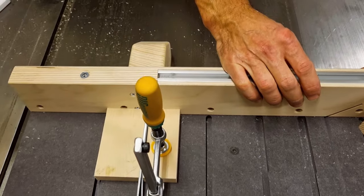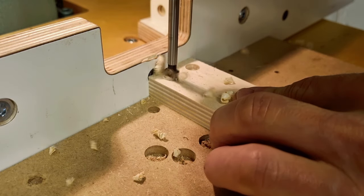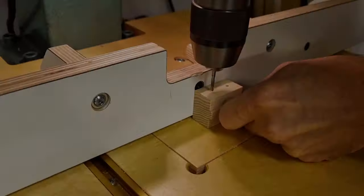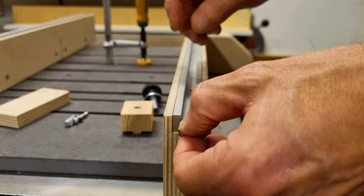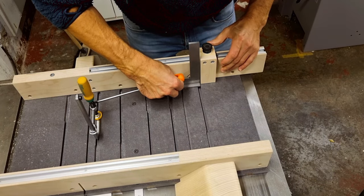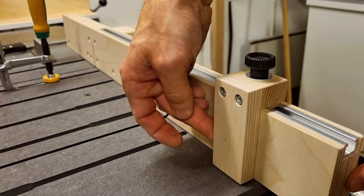The vertical part of my stop is a piece of plywood. I lay out the length, cut it slightly short, and drill two holes for flat-head screws. I use the center puncher to lay out the position in the other part and pre-drill for the screws. Using a square as a reference I attach the vertical part to the top part. Some light sanding and this stop is finalized — it slides really easily without any free play and is super stable sideways.